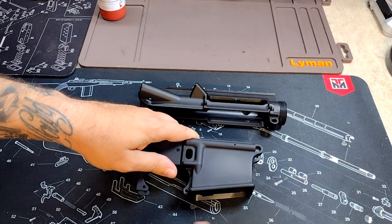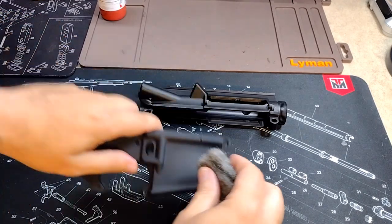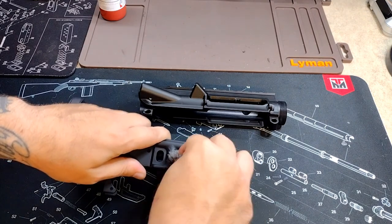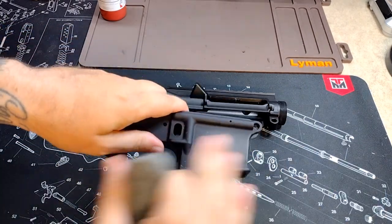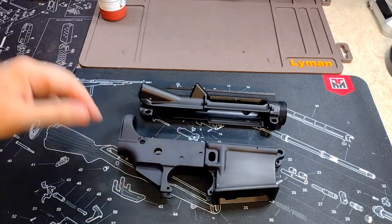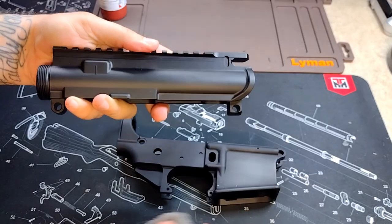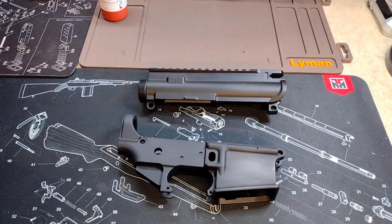So you could just rub it on there, just scratch it up a little bit. Let me turn the light on — maybe you can see a little bit better. As I start to do that, you see the color changing a little bit on there. That's because it's starting to scuff it up a little bit. I mean it's not doing much — on a microscopic level you want this finish to open up, like you want the pores to open up on the finish so that your Duracoat will adhere to it. Now if you find that the steel wool isn't going to be tough enough — which I know it's not going to work on this one — that's going to do absolutely nothing to that.